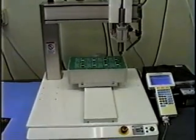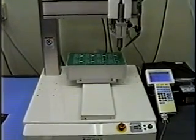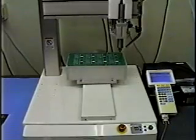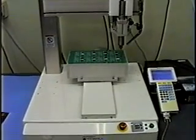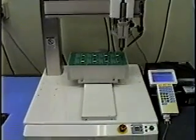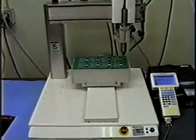The PC software, called JRPoints, is available as an inexpensive option which allows the user to program the machine using a DXF file. This software allows you to create an infinite number of programs and download them to the robot as needed. The software includes a compiler that converts DXF files into JCS format, which is the robot's resident file.